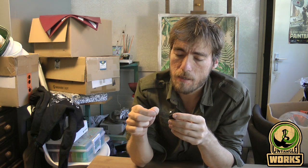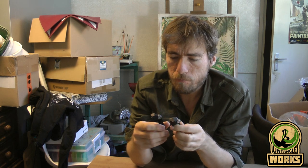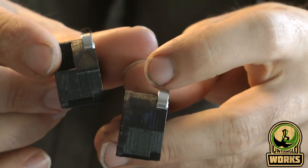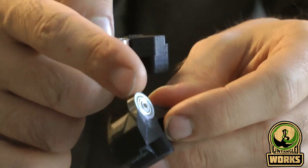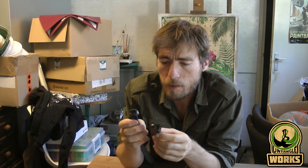In my mind, this maybe gives a little bit of movement in the wheel and maybe a little bit more friction, but I do not really notice it. I've made an improved, or special-made, hammer. That one will have a little groove — the gap is so small that I don't think you can see it — but it gives a little bit of a gap and the roller bearing will rest in the center on this side of the hammer, so it has no friction against the hammer. That's basically the only difference between the two hammers: a little cutout and a little pin.